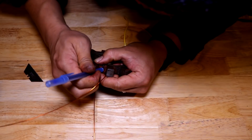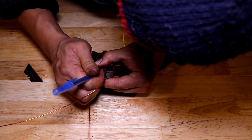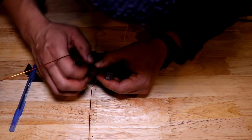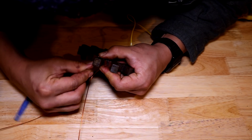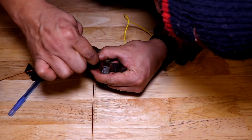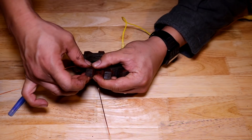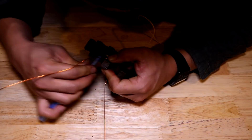For this stator, I'm mimicking what the original stator had in terms of turns, and I'm doing about 20 turns per pole. A turn is literally just one wrapping around the pole. So I'm going to wrap the wire 20 times around one pole in a counterclockwise direction and then move on to the next pole and go clockwise 20 turns and so forth. I do that until I get all the way around and I listen for the beep on my continuity tester. If it beeps, it means somewhere on a corner perhaps the edge of the actual stator laminations cut into the copper insulation. If it beeps, I don't have to give up and start all over - I just have to reposition that wire so it's no longer touching the laminations.